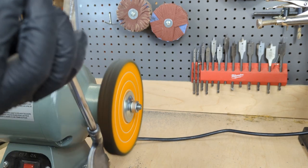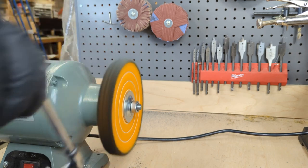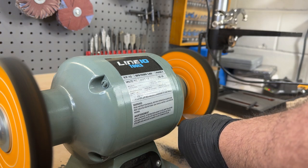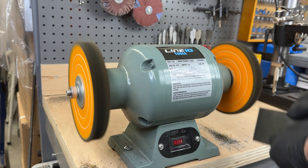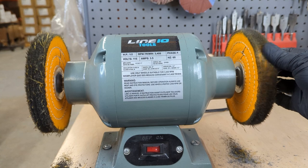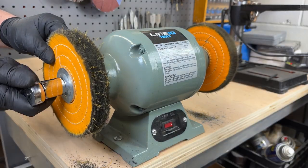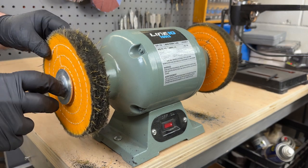It's also a good idea to clean the buffing wheels once you are finished using them. I will use the point of a scraper edge very gently, separating the plies — this will remove most of the used-up compound, which can sometimes be baked onto the surface of the wheel. That looks pretty good to go for next time. And of course, I forgot to clean the left buffing wheel.